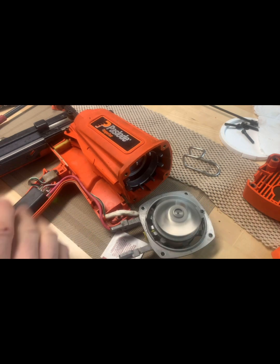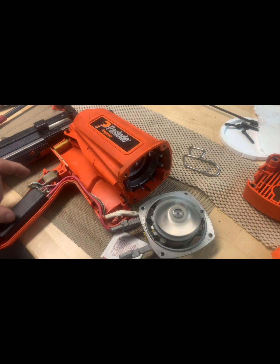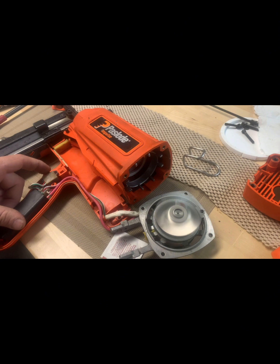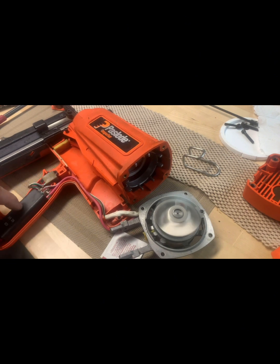And I don't think it's the trigger. I did spray some around to clean it. Maybe the oil causes it. The reason I think it's not the trigger is because, watch, when I hit the trigger now, the fan will go on. See? If that trigger didn't work, it probably wouldn't have turned on that fan. So I don't think it's the trigger. I think this unit is bad.